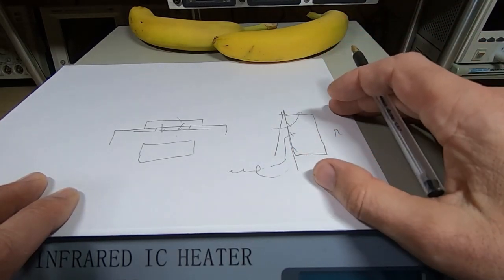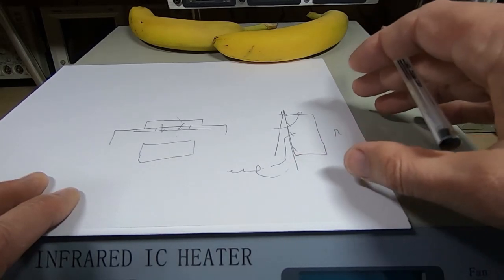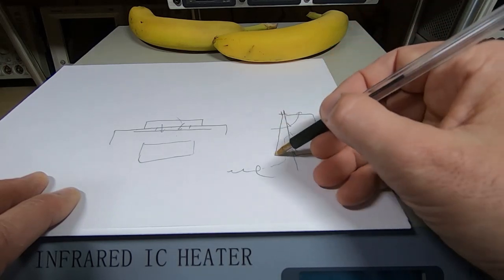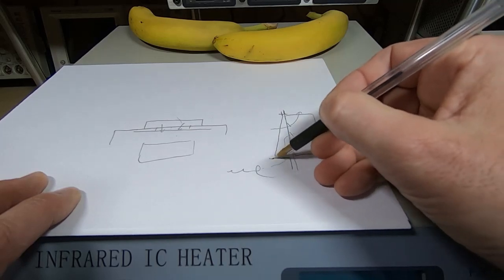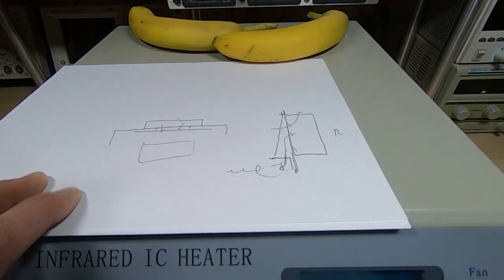It helps with the profile during heating, and it certainly helps and gives the controller more authority during the cooling part of the process. So that's quite an easy one to do. The bottom edge of this, of course, needs to be just above the level of the drawer. So it's not sitting behind the drawer, it sits just above the level, and then air can come down and mix between going into the drawer and down behind the drawer.